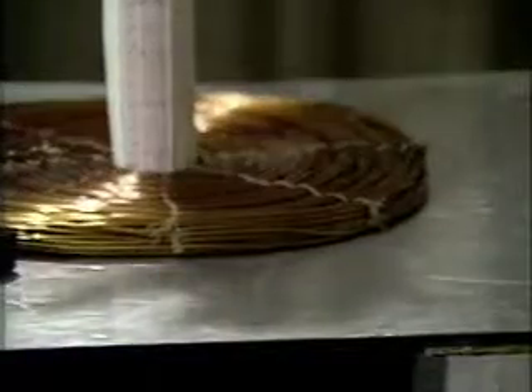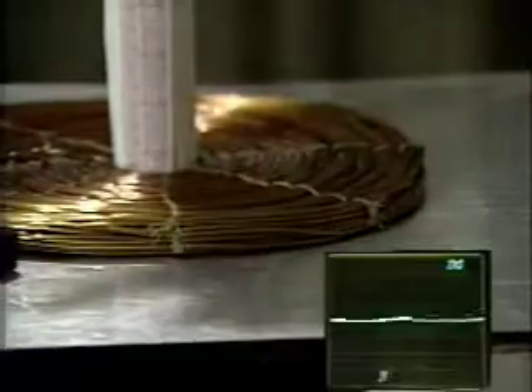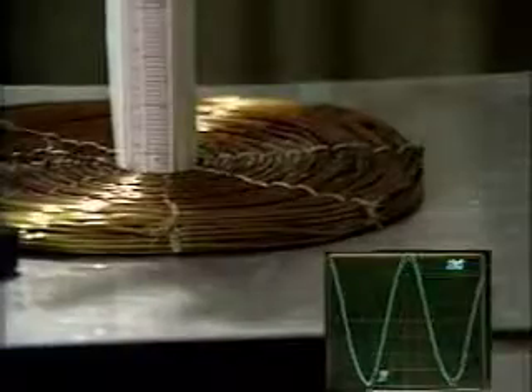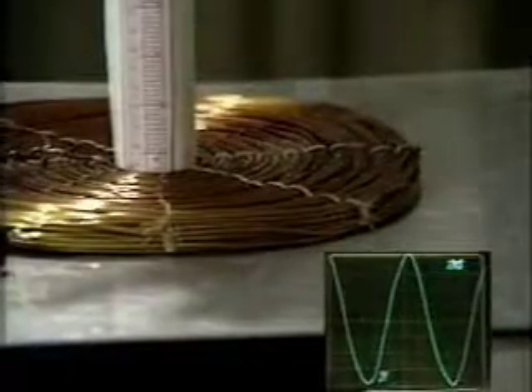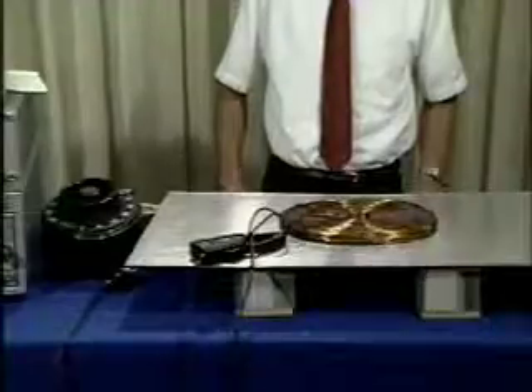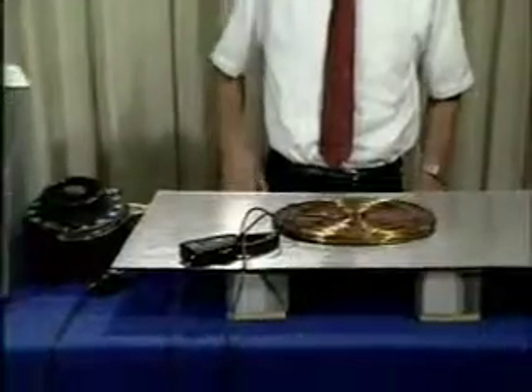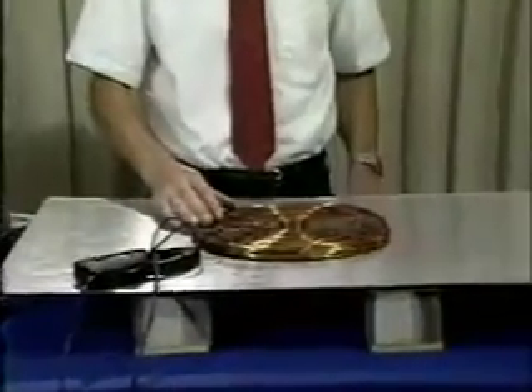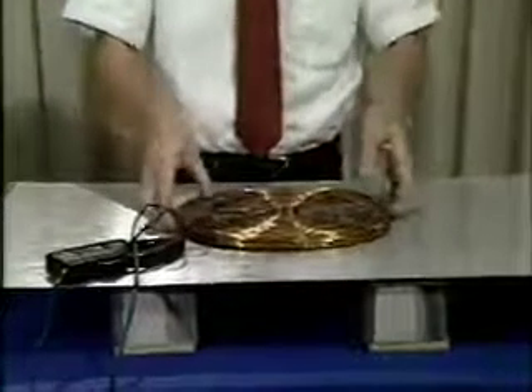With a 1 millimeter thick plane, the coil does not lift up even at 30 amperes RMS. The ground plane is now so thin that most of the magnetic field penetrates through it. We just blew a fuse — this time because of an arc. The enamel insulation on the wires may not be enough to prevent arcing to the sheet. Let's try it again now with some gaffer's tape for better insulation on the bottom.